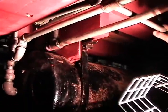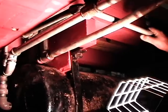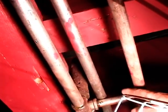This is kind of a rat's nest of pipes in here. When we took it apart, we wondered if we'd be able to get it back together again, but it turned out without the floor there and so forth, we were able to do it — and we hope it's right. This little device right here is a safety valve. This will blow off if the air compressor doesn't stop and the air continues to flow into the system. Normally they're not located in such a hard to get at place, but this is where it was originally.